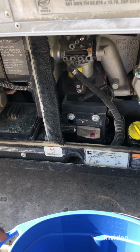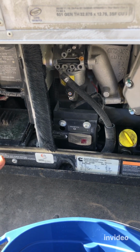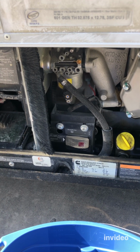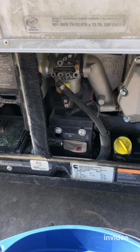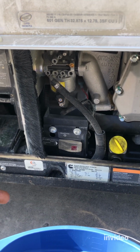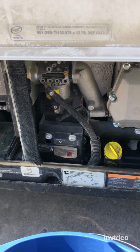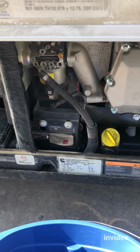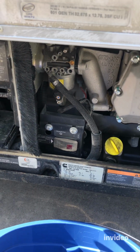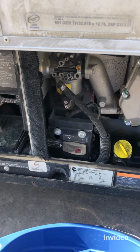But it's not a 100% guarantee that your fuel pump is working, because right now it's cold, just the morning, so I never started it. It might work right now, but when it's really hot and you go to higher elevation or hot places, then it might not work. So it might be intermittent. I'll just check this anyway, but even if the fuel pump is working right now, it's not guaranteed. Right now it's like 80. When it's 100 above, it might not work.